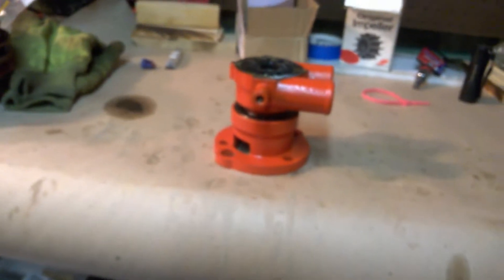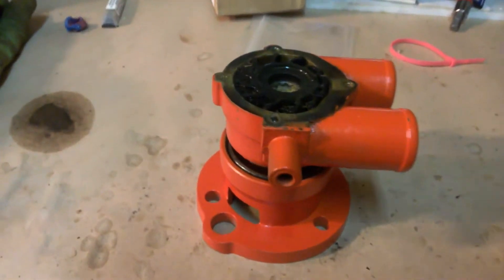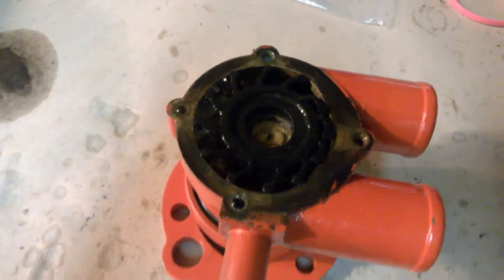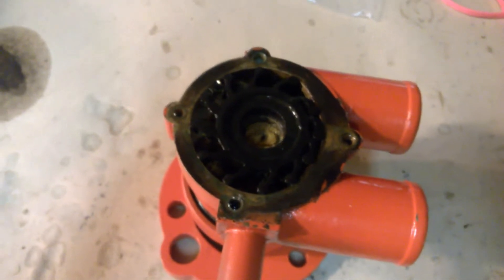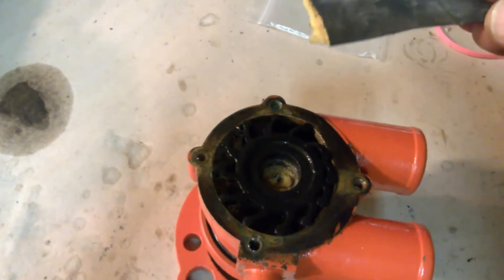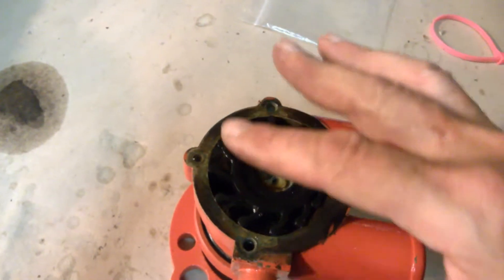So we're back, that's the finished baby. I have it all back together except for the cover, and the liquid you can see on there is dish soap. That's the easiest way to put the impeller back in — coat it all with dish soap, it slides right in. I did get some emery cloth to just buff out the inside of the impeller housing.